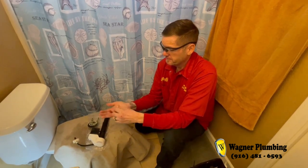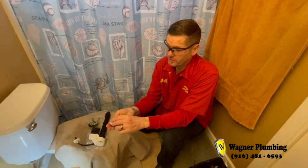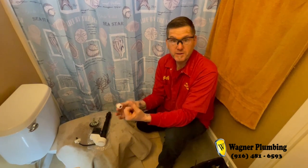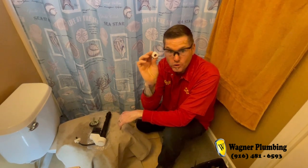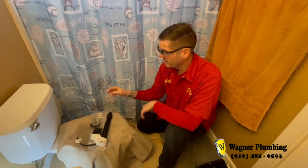In the new part they give you these two pieces, which are for a fill valve supply line that in most of the U.S. is now illegal for a plumber to install. As you can see, the flexible tubing part that goes inside this hole to make the seal is not mechanically connected to this part, which means if you had a severe pressure increase or decrease in your water, this piece of rubber tubing could pull out and flood your house. Mostly everywhere in the United States this part is illegal. Since the maker of this brand sells them in the U.S. and overseas — South America, Canada — some people still use this style, but here in the U.S. we don't. We just take this part and chuck it in the garbage, because it's worthless to us. If a responsible, licensed plumber is coming to the house, he's not using that piece — he's throwing it away.